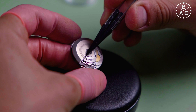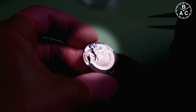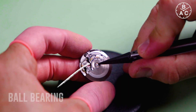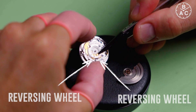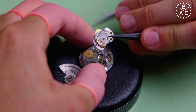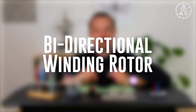Here we have an automatic wristwatch movement with an automatic mechanism. Commonly used today is a semi-circular weight which can rotate 360 degrees and wind up the mainspring in one or both directions. This is the rotor, which can move freely around the central axis of the movement. It is equipped with a ball bearing to minimize friction and ensure a long service life. A sprocket is attached to the bottom of the rotor which engages with two reversing wheels. A ratchet mechanism inside the reversing wheels ensures that the two-sided rotation of the rotor is only transmitted in one direction — this is why it is called a bi-directional winding rotor.